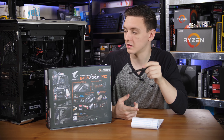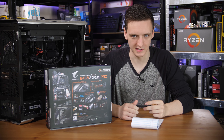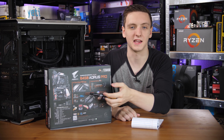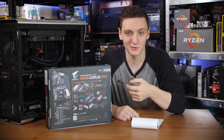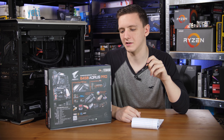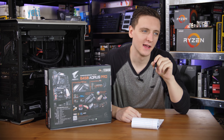That was something made public pre-launch. My review of this board was a launch video made before any of that was mentioned, so while I did say it's an 8-plus-3 design — which is technically wrong — my comments on its performance were completely unbiased to whether it's 8 or 4 phases. It still handles the 2700X just fine, still hits its full boost clock, and you still get full performance. Even under synthetic 100% Prime95 load, the VRMs didn't get above 70 degrees Celsius, and the chip itself didn't throttle at any point under full load, gaming load, or benchmarking load.